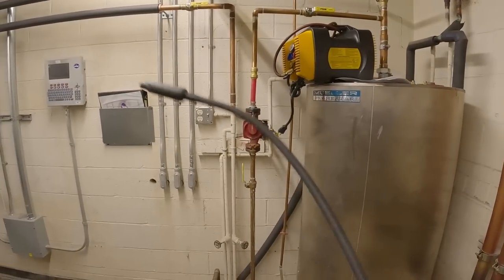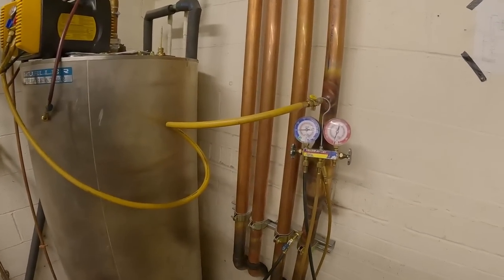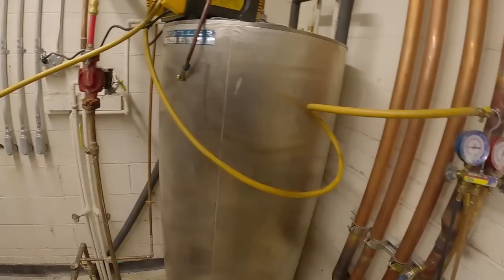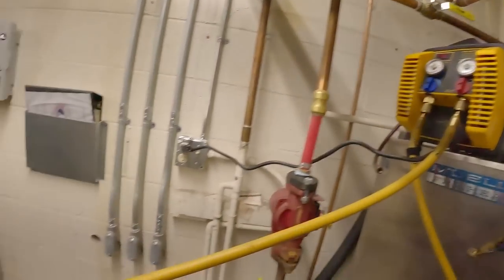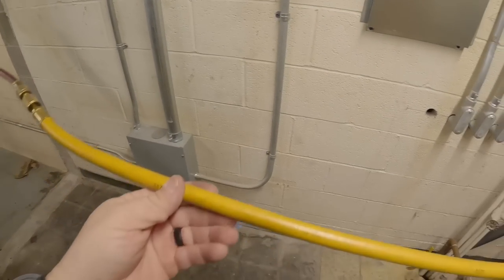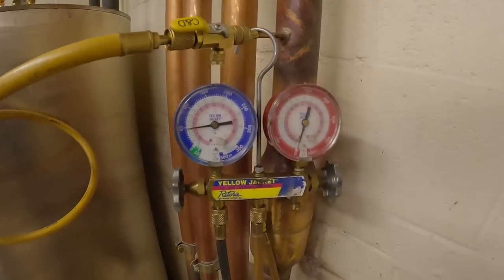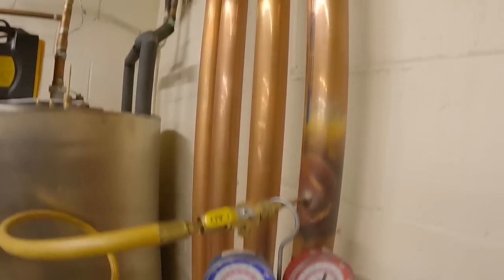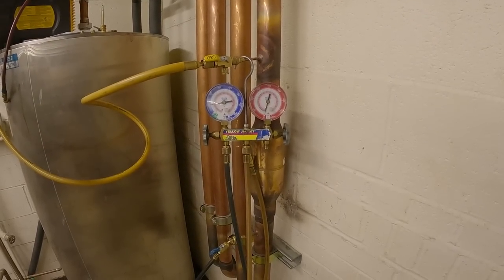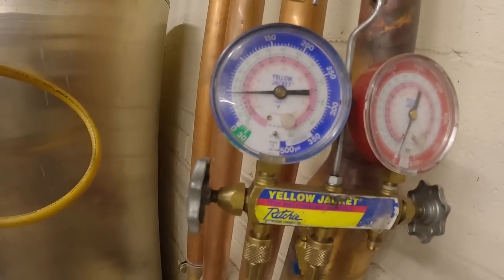We've got a recovery machine. We're going to see if we can get that pulled out of there. The valve core is pulled and we're monitoring over here. We're pulling through a 3/8 hose as far as I could, then going to quarter for the last bit. This is the high-side discharge side. My biggest worry was something leaking through — at least this way I'll be able to tell if it's dropping, and it already dropped five pounds.